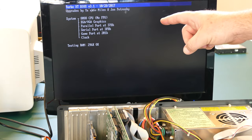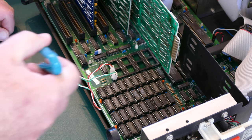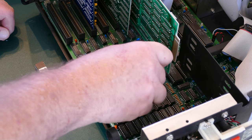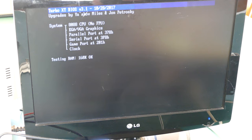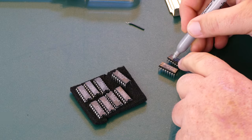In the last episode, I used a newer BIOS to determine there was a memory problem in the second bank. Now that my replacement memory chips have arrived, I started in the middle of that bank, putting in a replacement chip and checking the BIOS to see if the memory address moved around. Sure enough, it did — I got lucky and fixed one bad RAM chip, but there was another bad one. After swapping a few more chips, I found the second bad RAM chip, and on boot it now reaches a full 640K.